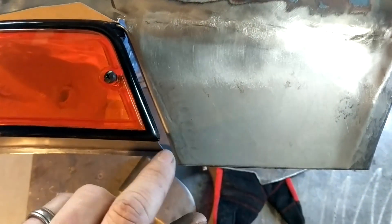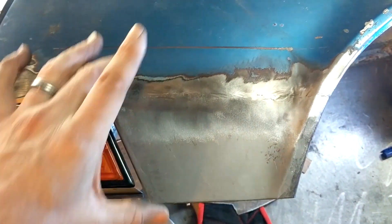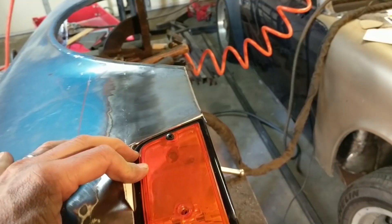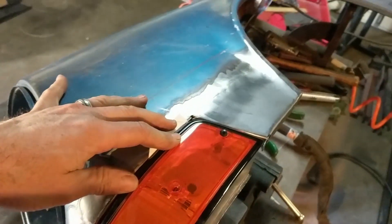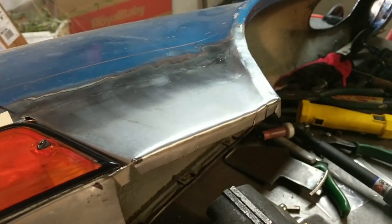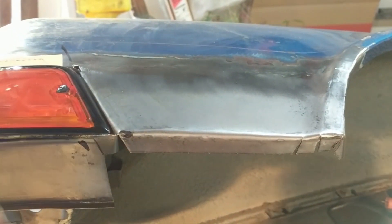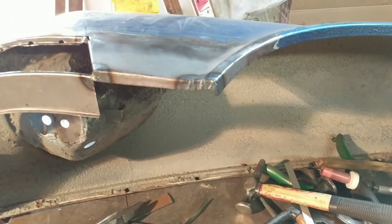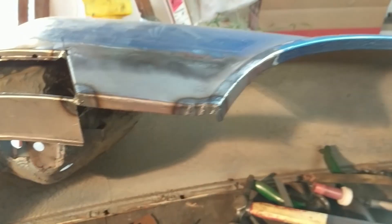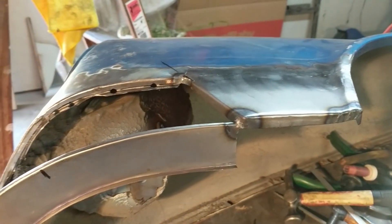It's time to put the camera down, mark this carefully, and reference this line up here. This line was based on the original shape, so I'm going to make these lines parallel all the way to the back and then bend it along that new line. Here's the flange — the bottom of the fender lip — which has been moved and reshaped. There are a couple of pie cuts here which I'm going to weld up right now, and then reattach this so we have a complete box for the housing. I just welded in these pie cuts to cap off this lip with the wheel arch, and there's a bracket that goes across like a gusset which is also an attachment point for the turn signal housing.